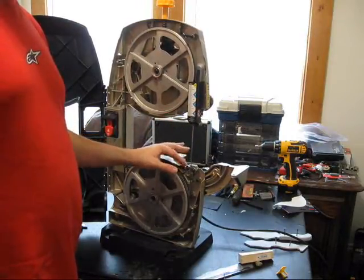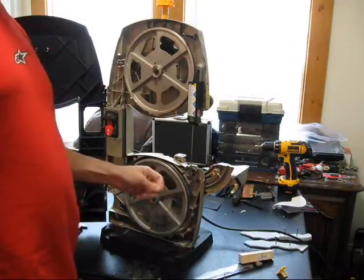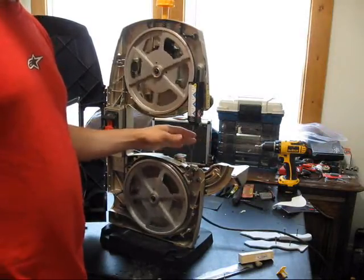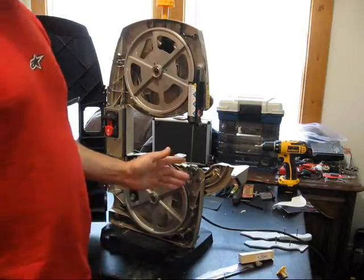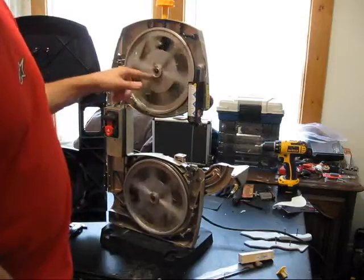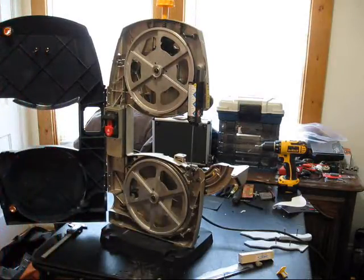The third tip was having the guides — whether they're bearings, metal blocks, steel blocks, or cool blocks — they should not be touching the blade. If they touch the blade, it's going to cause friction. Friction causes heat and that's going to deform the blade. Some people use a piece of paper to set the gap. But he says to check it by actually spinning the wheels, because that's the only true way to see what's going on with the bandsaw.